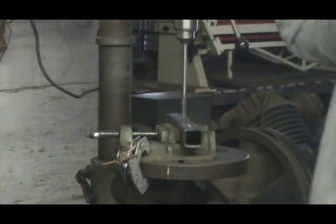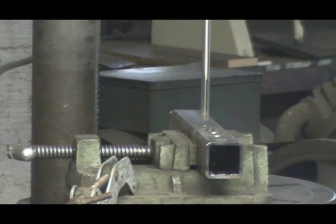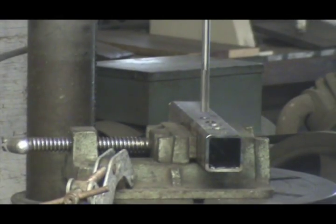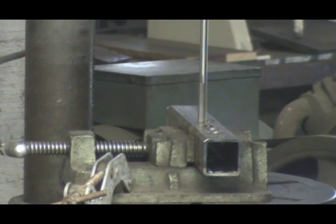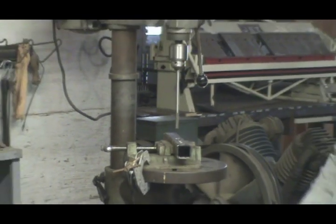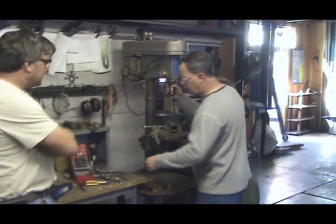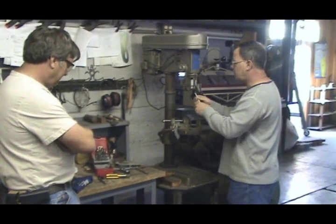That's a little bit fast. This is another good point — a lot of people say my drill press doesn't have a whole lot of speed. In this case Kevin's got a five speed, but we can go ahead and drift it. And there you go, you've got a reamed hole. We don't want to go super fast because the faster we go, the more it wobbles and the bigger size it gets, plus more heat. You can use oil with it — that usually helps, especially with non-ferrous materials.